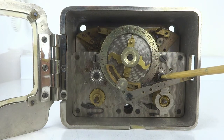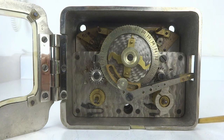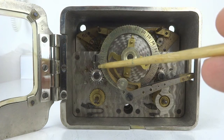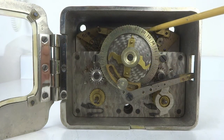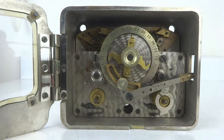It's really the same principle as what was demonstrated in their Type 1, but has a little bit more of a safety feature in that it doesn't have to drag upon the other movement through the ratchet work directly connected to each of the carriage clock movements, but is done through this dial work here.